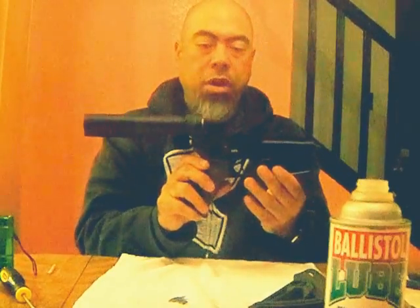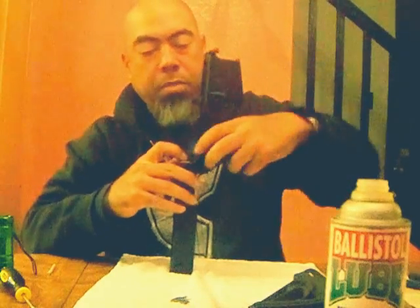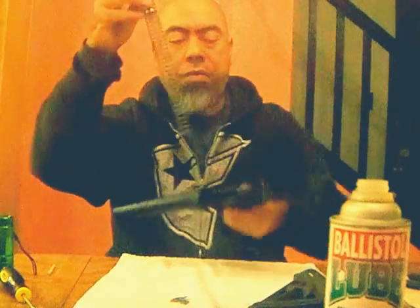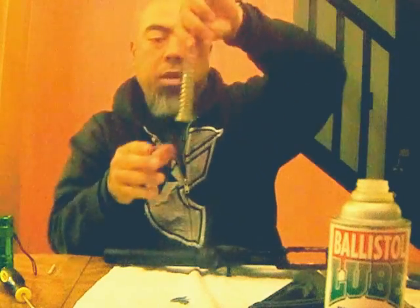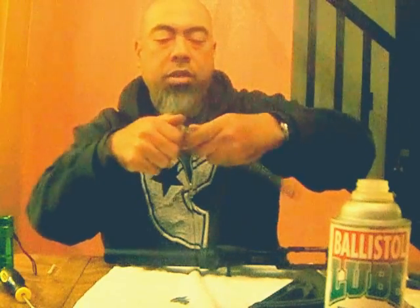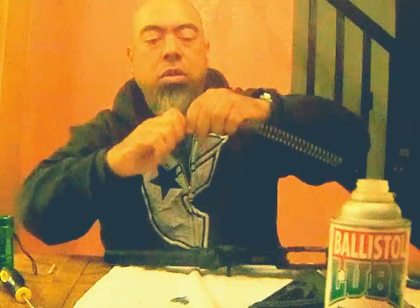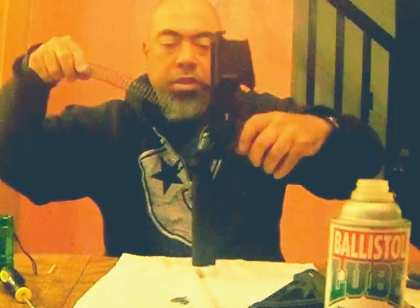So here's what I've got so far. I forgot to talk about the buffer tube and the buffer tube spring, so let me get that out for you. Here's the spring. Both ends of the spring are the same, and you just put it on one end — instead of just laying it on there, you kind of screw the spring on there so that it attaches and stays. And then you just place it in the buffer tube.